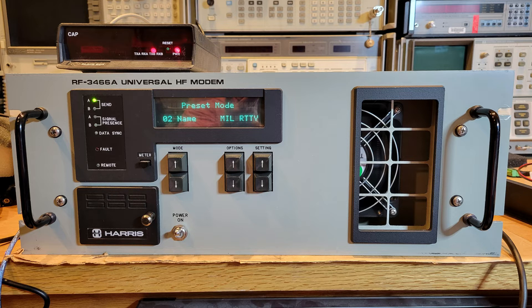The modem supports three basic waveforms and some combinations of these waveforms. The waveforms are 39-tone mode, robust serial mode, and fairly standard audio frequency shift keying — or RTTY as the amateurs call it, or RATT as the military people call it. I won't go into all three modes here today, as they are quite beyond what we could hope to cover in a video. However, I will focus on getting the FSK worked out and functioning for amateur RTTY.